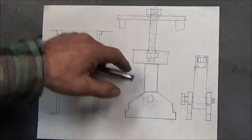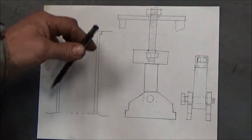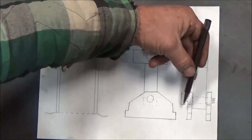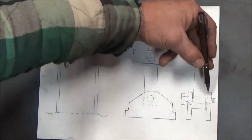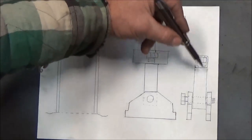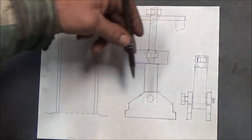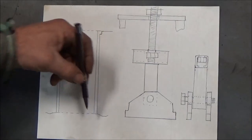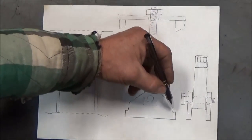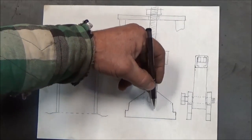You flip these things up sideways and drop it down in from the top, push it far enough down so they fall back to their natural position. There are two of these. This is a side view of the same thing — here's one, here's the other one, and a bolt going right through the middle with a piece of square tubing coming down that keeps these separated. So there are two of these that are going to hook into the bottom of the cylinder, on the outside of it. That's what's going to hook on the bottom and pull it out.